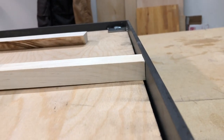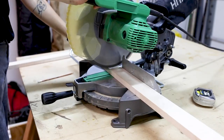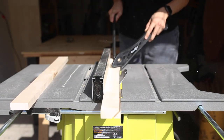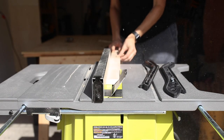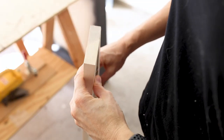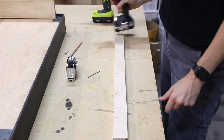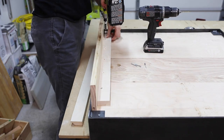The space that we left behind the tabs worked perfectly and fit the cleat wood just right. On my miter saw, I cut two pieces of the wood to 24 inch strips, and then I moved to my table saw and ripped both pieces to have a 45 degree angle on one side. If you aren't already familiar with this mounting system, one side is attached to the wall and the other attached to the piece to be hung, held together by gravity. I'll leave a link below to a good French cleat tutorial if you'd like to learn more. And this is how the two pieces will fit together to mount. On one of the strips, I pre-drilled five holes for my screws and then used a countersink bit so the screw heads would sit flush. I used a wooden spacer to evenly set the cleat slightly away from the top of the metal frame, and then I screwed it securely in place.